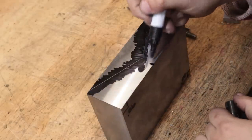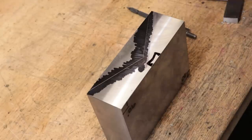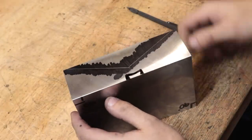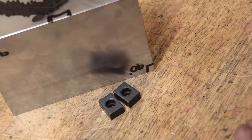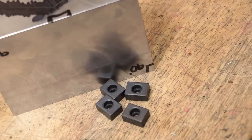Taking notes from the V-blocks that Curtis made, I'll be machining a slot down the centre so I can key it to the table's T-slots. That should hopefully make setting it up square on the table a lot easier and quicker. I don't have any key steel in the right size on hand, but I do have some oversized keys which I got with the dividing head, so I'll machine these down to fit the T-slots on my table.